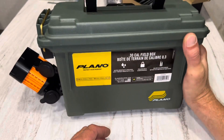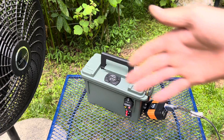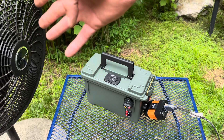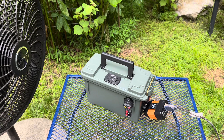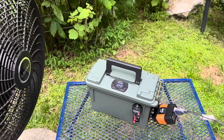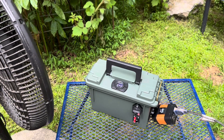So it's just an old Plano box that's now an affordable, easy DIY portable power station. Time for the load test! I've got my oscillating fan right here — this is what I built this box for, instead of having to drag a big power station out. This fan pulls about 40 or 50 watts, so it'll run about three and a half hours or so, considering losses to the inverter. Great for keeping bugs off you in the garden in the evenings. Power it up — inverter's on — plug in the fan, and it's oscillating. No skeeters gonna stick around with that blowing on you!